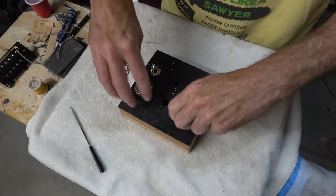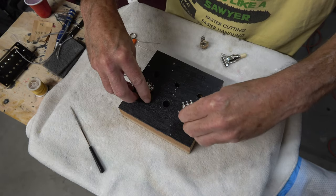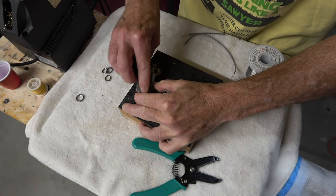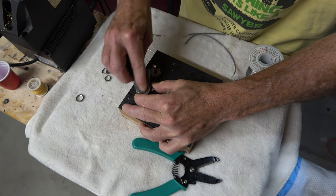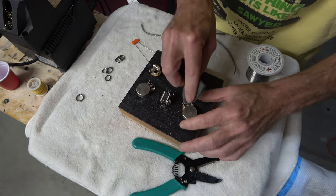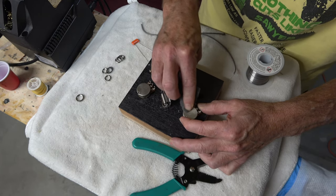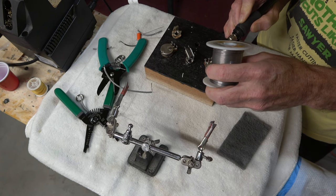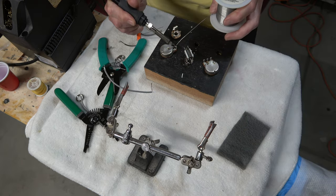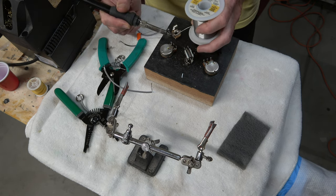The first thing I've got to do is organize all my electronics before I solder everything together. I've got a block of wood that I've drilled holes into, and that allows me to hold all the electronics while I solder. That way I can do the work before installing it into the guitar. Since I'm going to be soldering to the back of the pots, I need to scuff the surface with some synthetic steel wool to allow the solder to adhere better. Next, a blob of solder is applied to the back of both pots — that's where the ground wires are going to be attached. Before I can solder any connections, I like to pre-tin all the lugs to ensure a better quality solder joint.